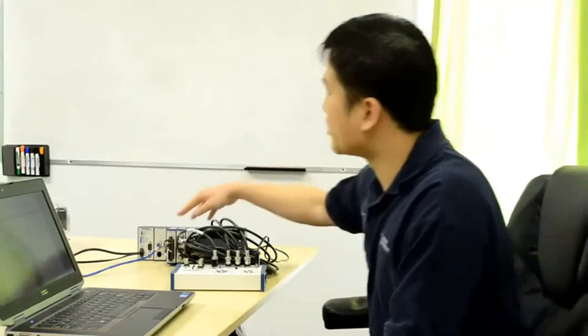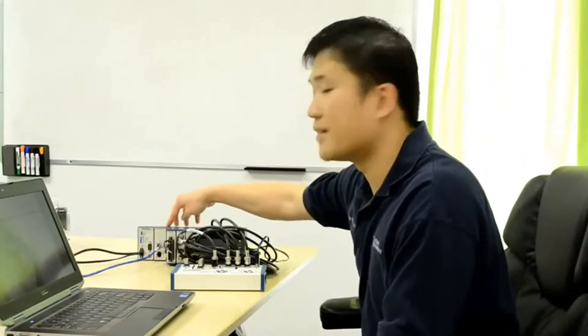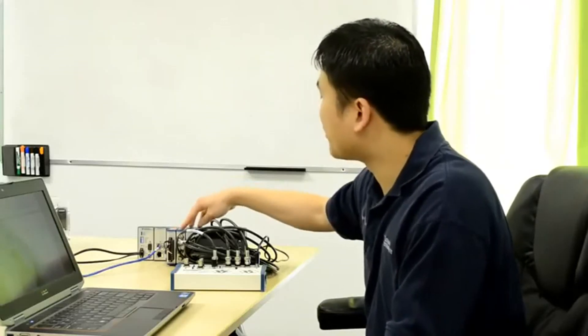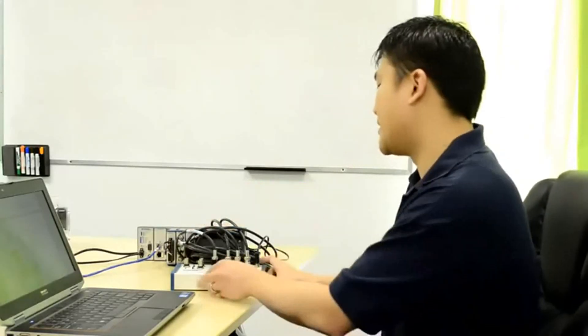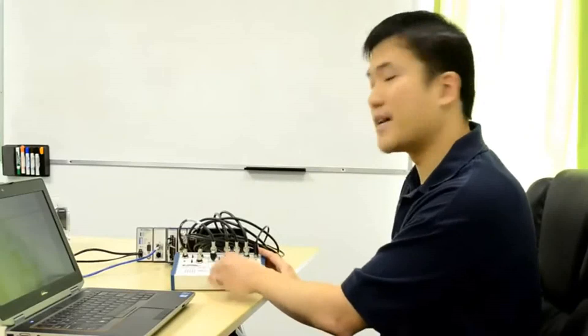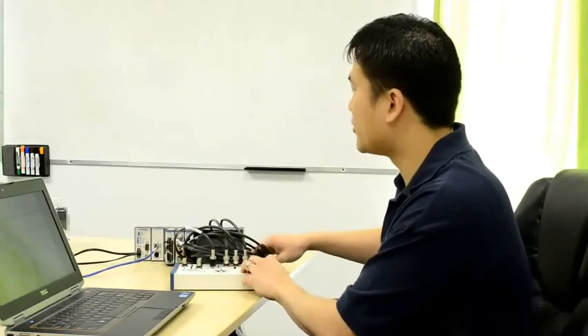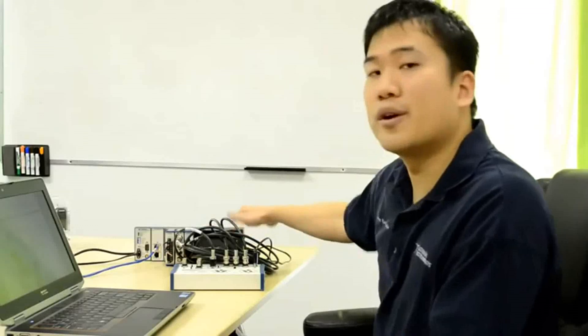In the classroom version of this course, students will use a CompactRIO 9074, a 9211 thermocouple module, a 9234 analog input module, and a 9263 analog output module. These will interface with a sound and vibration signal simulator which has a balanced fan and an unbalanced fan. I'll demo these exercises for you and you can follow along in the exercise manual and create the same VIs and FPGA VIs. However, if you do not have hardware, you won't be able to run them, but you'll still get the experience of developing them in the LabVIEW FPGA environment.